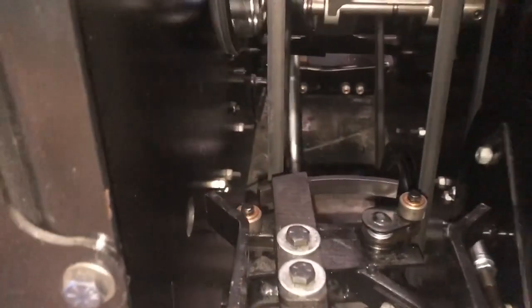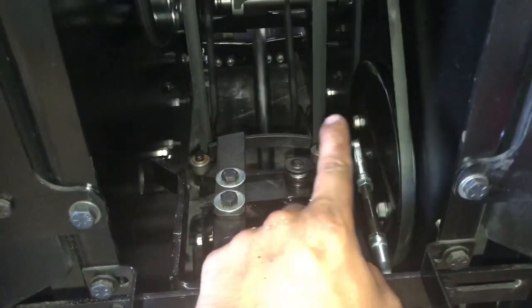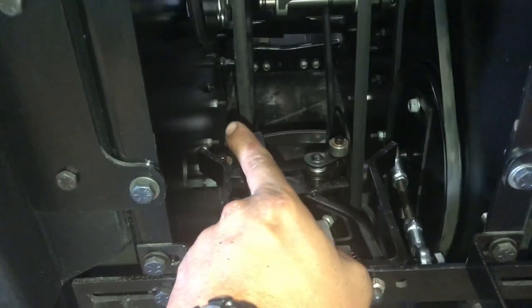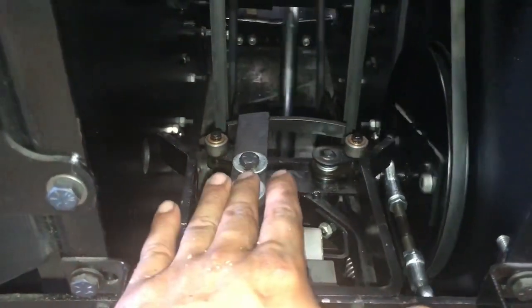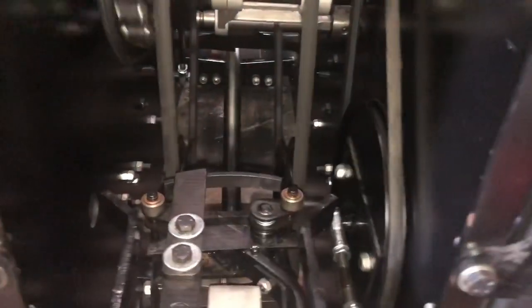Now watch it reset — there we go. She's good to go. I've got good travel. You can see there's a little bit of movement where the pulley's still pushing even though the paddle's reached the end of its drive. That's good — we want that little bit of hesitation at the end so that we can push stuff out, push a pin out, and it'll stay out instead of just rolling right back into the door. You can see the trip cam move after the whole assembly stops. We want just a little bit — just like that.